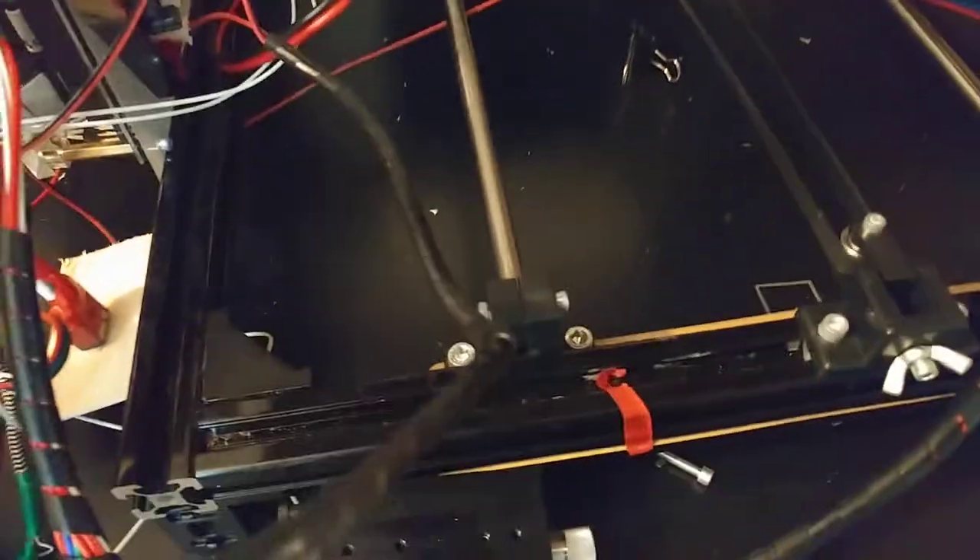Here's the printer back in place. Now I'm just gonna hook up all the wires to my ATX power supply, which is mounted beneath the printer on the table. There's the other printer, which I could use, but it was in use when this whole thing started. These are really crappy Molex adapters, and you can see when I try to plug them in, some of the pins come out — which is fine because the power supply's not on right now, but just be aware so you don't end up shorting anything out and causing a fire.